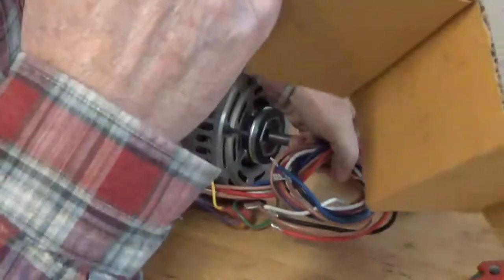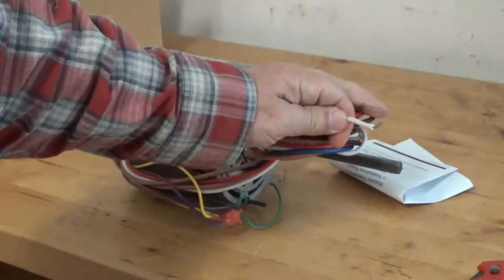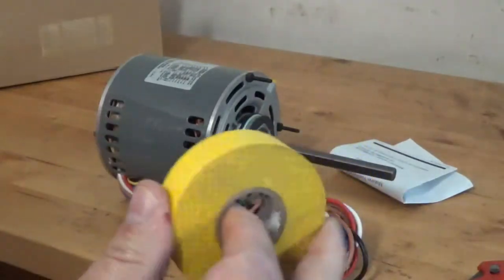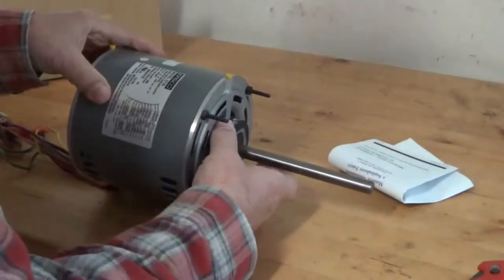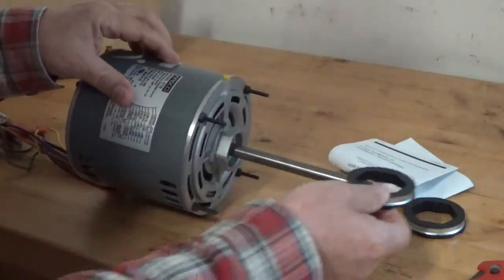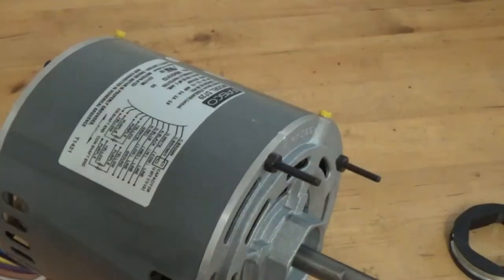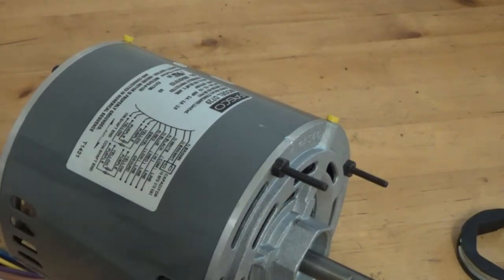Just what I suspected. On our current motor the white line is yellow, and then the blue line. While I have my yellow tape here I'm going to mark it as yellow so that it matches the original schematic. Also on these motors — if you're a technician in the field you'd remove the unused wire leads. Next I'm going to remove the caps and put a few drops of oil in there, just normally do that every spring.